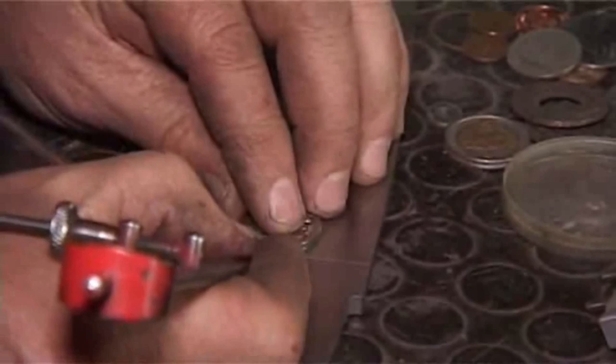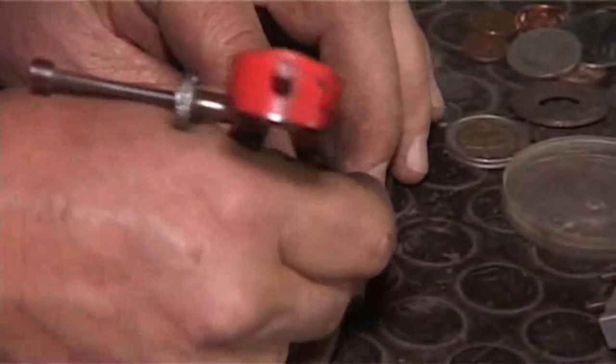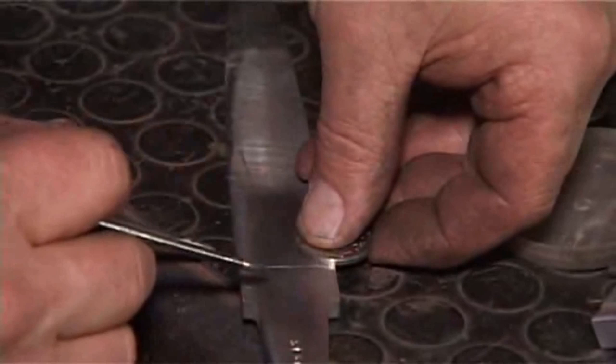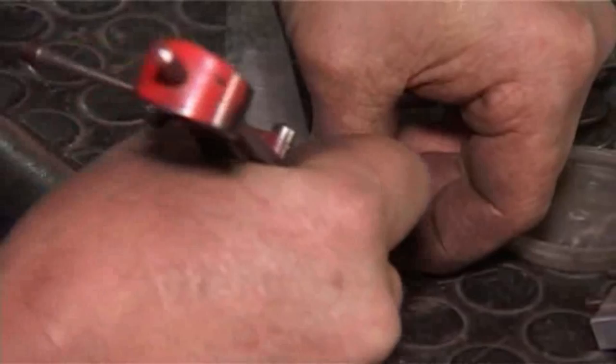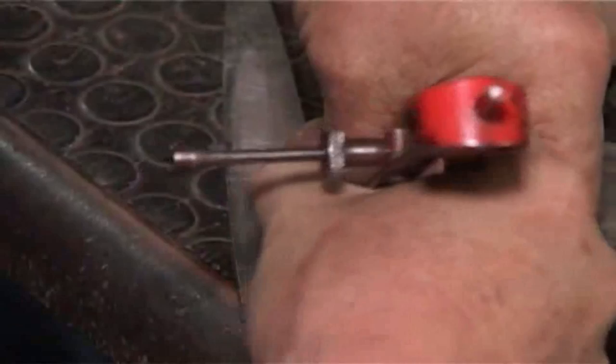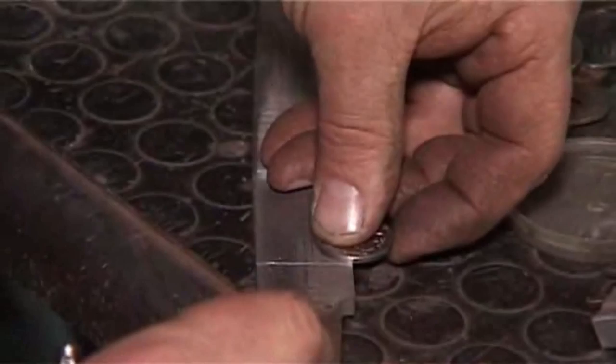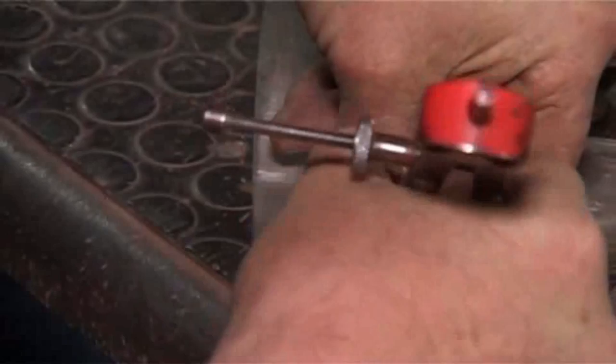Now, a lot of people, bladesmiths that is, will try to forge the bevels. That's also all right, especially if you've got a double-edged dagger that has double choils, where the cutting edge is wider than the ricasso, you will forge the bevel somewhat. But on this knife, I would simply forge my dagger to profile and to taper, distal taper. I wouldn't attempt to forge the bevels themselves. That just complicates the whole layout and grind, because if you've got one hammer strike out of position, it forces you to grind the knife in a certain way.